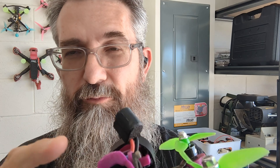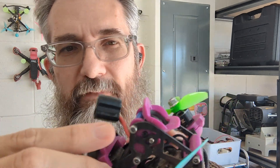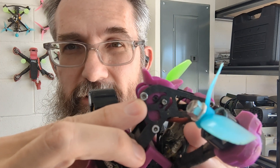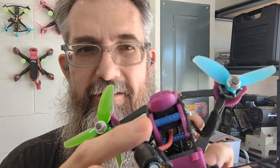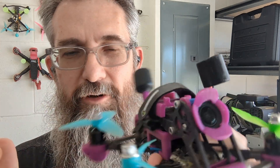The last thing you want to do with your screws — only for screws going into metal — is apply blue Loctite. On these screws going into the standoffs, I put a little bit of Loctite on the end and screw those in. That keeps vibrations from causing the screw to come out. For most builds I generally don't apply Loctite, but I find that if you do, it works way better, particularly for these standoffs. Because if you crash a lot, your props are going to get bent and damaged, and if you're flying with damaged props there's going to be a lot of vibrations. Those vibrations cause screws to come out. When screws come out, things fall apart. So apply some blue Loctite to your screws going into metal and use hex socket screws instead of button head screws — you'll have a lot more durability.